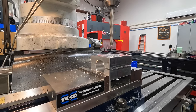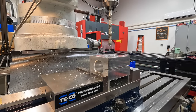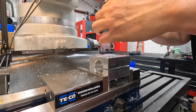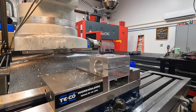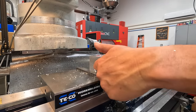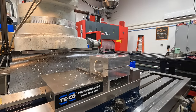Come down to just touch that threaded hole, and that's good. But I always drill it on size for your pilot. That's why we drilled it 3/8. So a bolt would still fit in there, but it's better if you've got a little bit of clearance for that thing to move around. So technically that is finished, minus we got to do some deburring on our split there. But other than that, this guy's finished up.